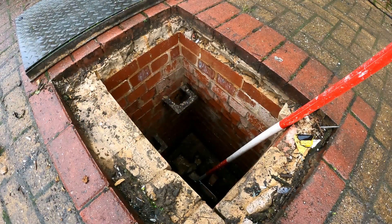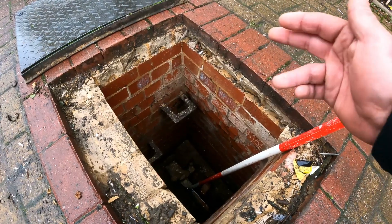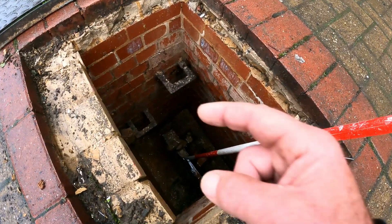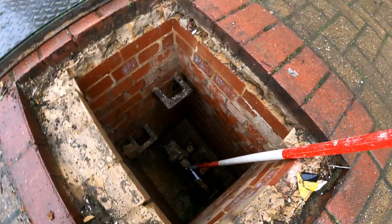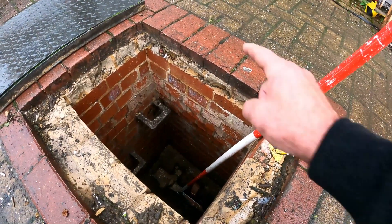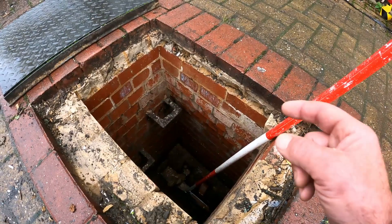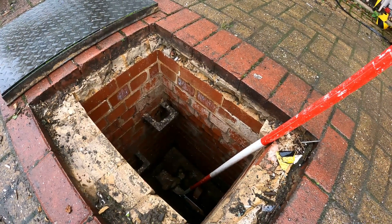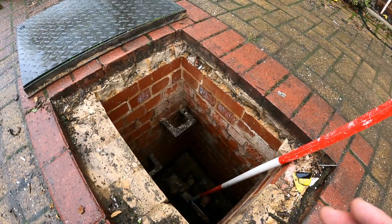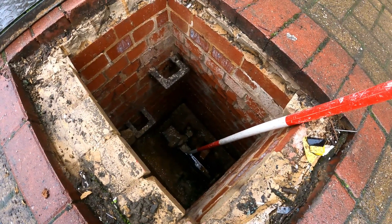I'm Creative Crambo back with another one. The brickwork on this manhole here is all collapsed — all them headers coming across there, cobbled over, are all snapped off. They've dropped into the channel down there as well, which I need to clean out. What I'll have to do is take all these block pavers out around here, take that brickwork out all the way around, and my only option I think really is to get some pre-stressed concrete lintels across there, and then re-bed that frame and lid on top of the pre-stressed concrete lintels. But I've got to get that out and I'll give that a rod through as well.